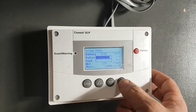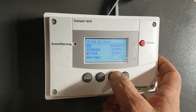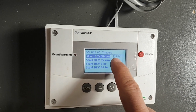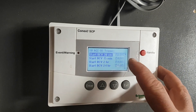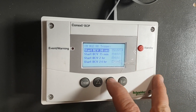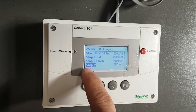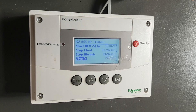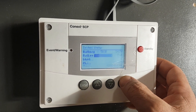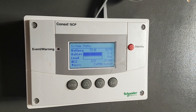I'm going to go into the AGS — automatic gen start. Go into the automatic gen start, go to advanced settings, then configure trigger. I have it set to start at 50 volts just for now. If you were off-grid, we'd probably bring that down to 46. These other voltages I left quite high just for purposes right now. When I go down, I have it set to shut the generator off at 55 volts — that's only for demonstration purposes right now. As soon as it gets up to 55 volts, which is coming up pretty soon, the generator is going to get ready to shut off.